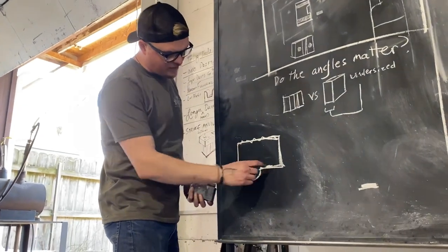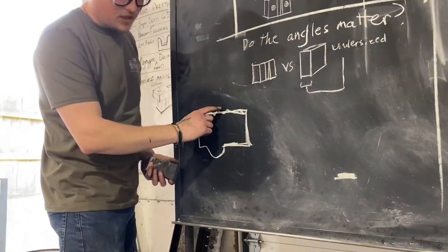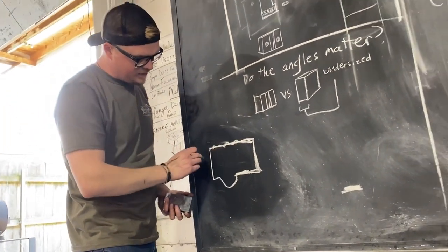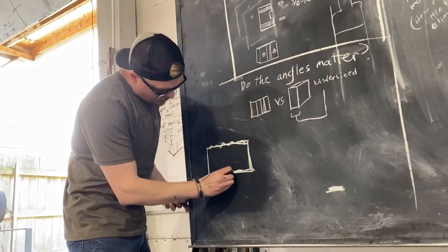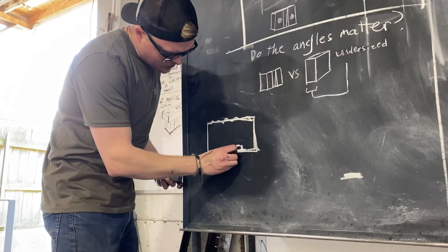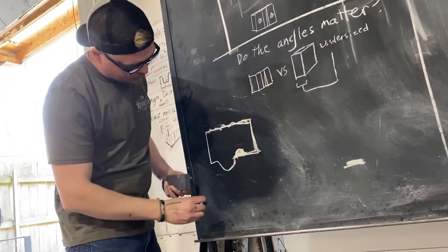So what we have is a very square billet, and we've got some variation in the surface up here. So what I like to do is grind this as clean as I can to get a flat surface. And then we're actually gonna set a fuller right here. So we'll set about probably a 1 inch or a 3/4 inch fuller.